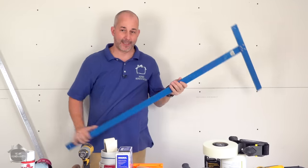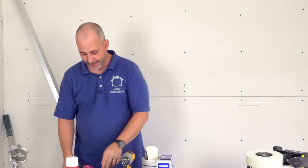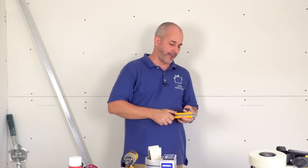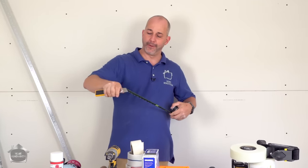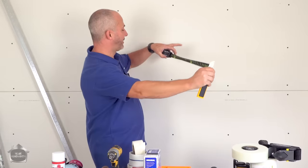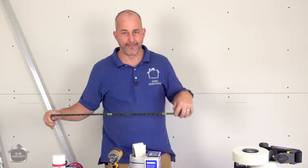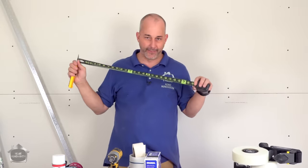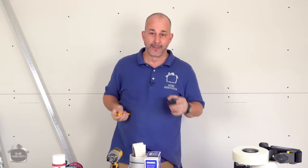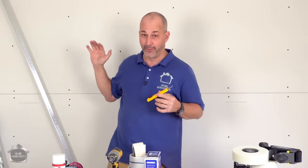I put that on my must-have list, although if you're a contractor, you're probably going, we don't do that where I'm from. We just take out our knife, take our measuring tape, hold the knife to the side of the tape, find the edge of the drywall and use my finger as a guide, right? And you cut like that. I get it. I don't suggest a homeowner doing some drywall work on the weekend is gonna be very proficient with this technique. So do yourself a favor and get yourself a square, because that will help you immensely.